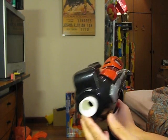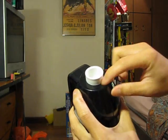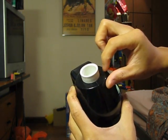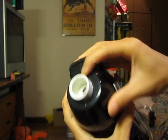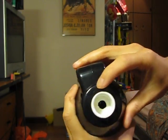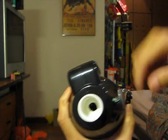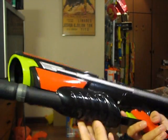At the back, I have solvent welded a PVC end cap — you can also use a cut down PVC coupler. The good thing I like about this is that it fits into this slot perfectly, with no Dremeling or anything else required. I drilled a hole through the end cap so that I can still access the screw at the back of the over pressure valve.